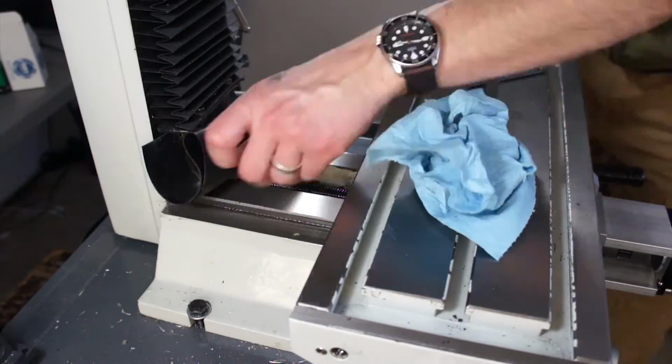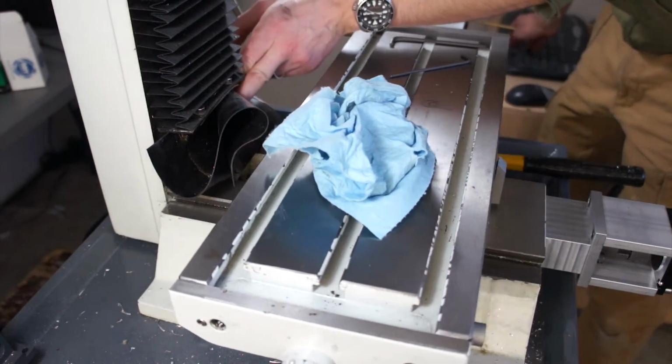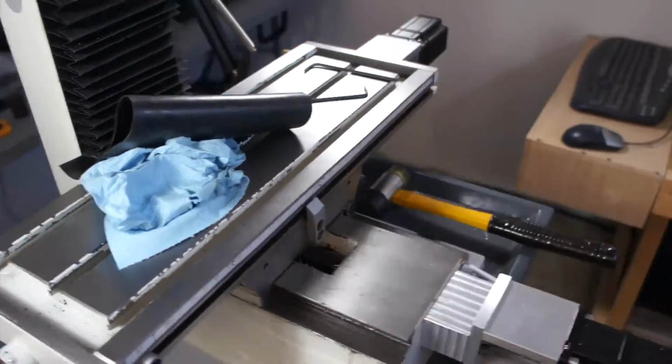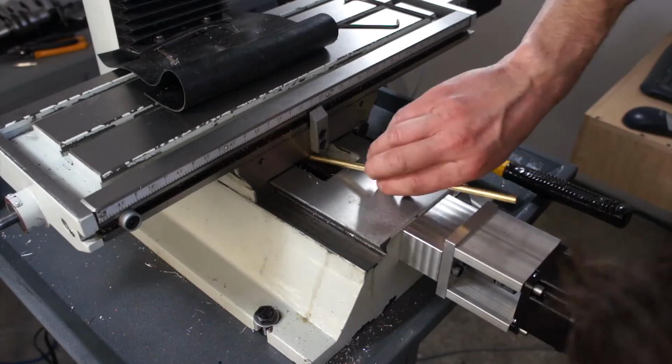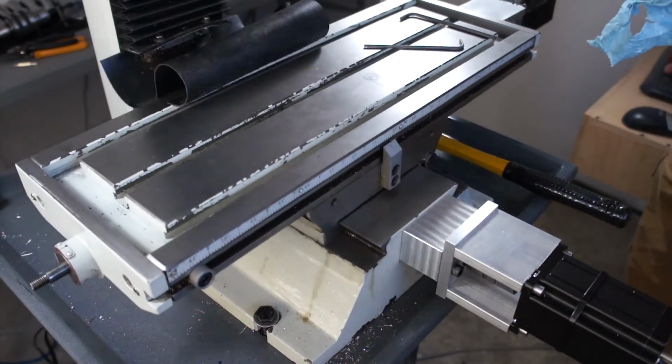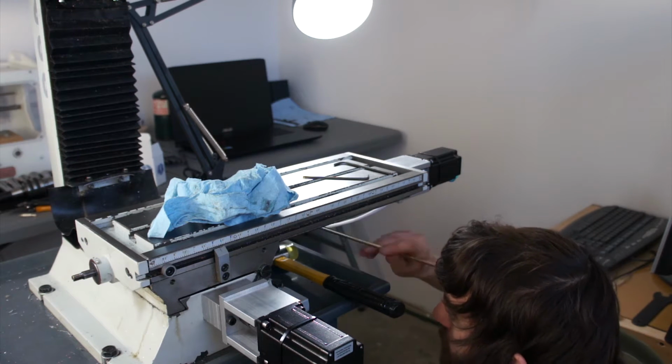For CNC control, the motion back and forth is going to present a bit of a wear issue, which is why ball screws are the way to go for CNC conversions. So I'm going to try to minimize that by just keeping the lead screws well lubricated, adjusting the backlash nuts every X amount of time, and just keeping watch on it until we do the full ball screw conversion.